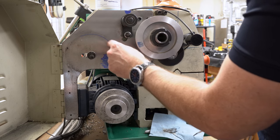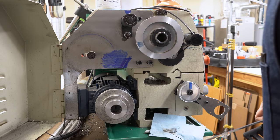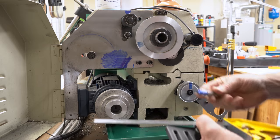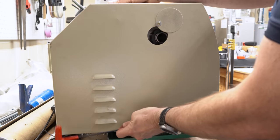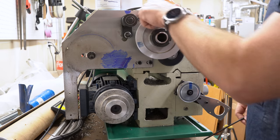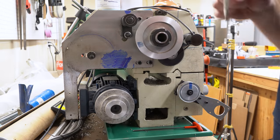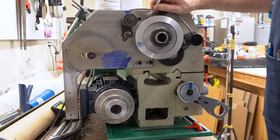I want to put the screws outside of this circle along those marks. I may try to put in four screw holes — we'll see how it all lines up. I know where my notch needs to be, and I'll transfer one other line here which is the back of the frame of the lathe. Now I think we're ready to pull this plate off and go machine it. I'm just going to scratch around the screws to make sure I have a reference for locating them when I put it back on.